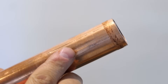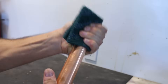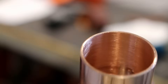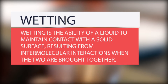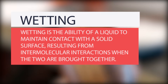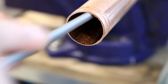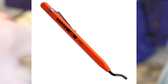The first thing that needs to be done is to clean the pipe and fitting. For the pipe, use sandpaper or an abrasive pad. This step is very important, as proper wetting is influenced by the cleanliness of the pipe and fittings. Wetting is the ability of a liquid to maintain contact with a solid surface — in other words, your filler material won't fuse properly if the surfaces aren't clean. Also, deburr the inside of the pipe using a round file or a dedicated pen reamer.